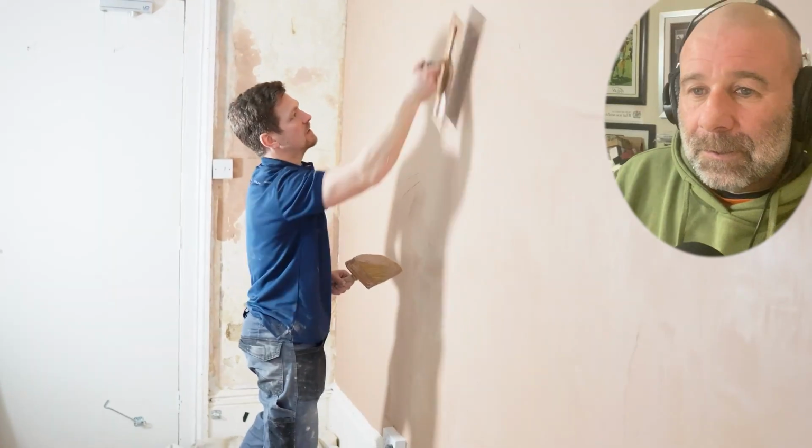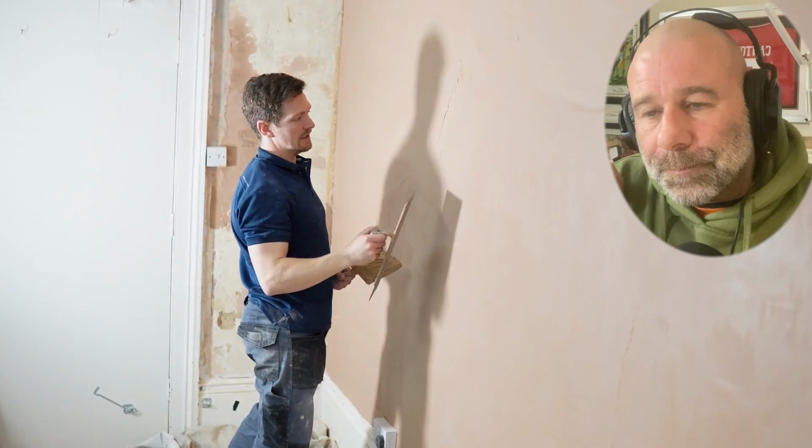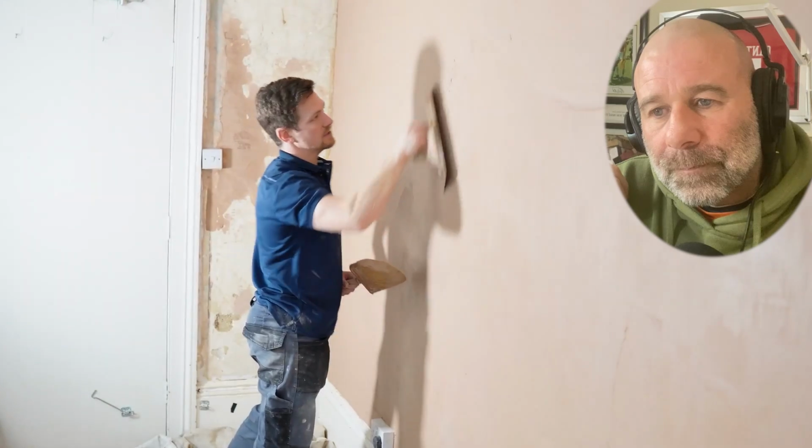And if you do have any places where you need to fill in, just get it off a pile that you've got. Try not to use what he's using, which is fat. Most plasterers will tell you this: always have some aside for filling in, not filling in with fat, because it will look a mess. So if you get any low spots that you'll see when you flatten, put it back on the wall, leave a little hump, and then trowel it out.